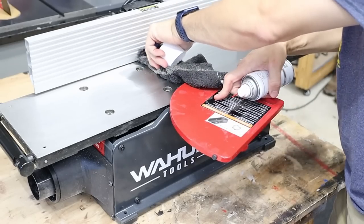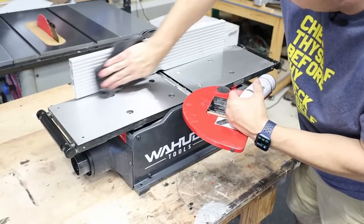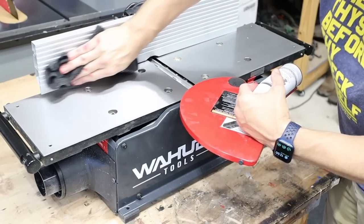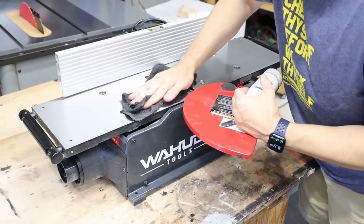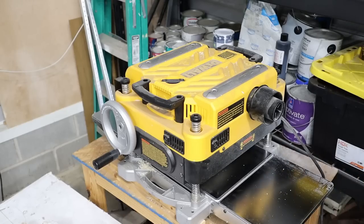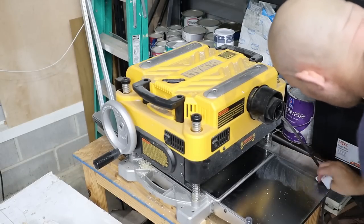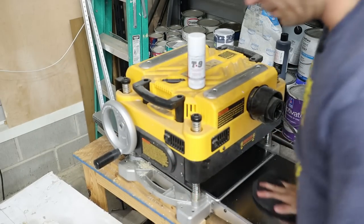What I really don't want to do is get any on those blades. I'm going to spray it kind of liberally and just wipe it in. I know that's aluminum back there — it's not going to rust — but if I can get this on there it'll help everything glide a lot smoother. If it works as well as it did on the tabletop cast iron, it's going to work the same. This will help protect that top and make sure it doesn't rust on me. This jointer has a little bit of pitch build-up on its edge too. This is unplugged as well — silky smooth.